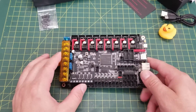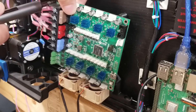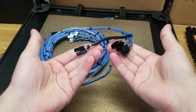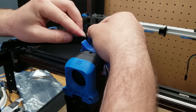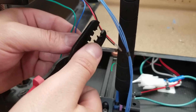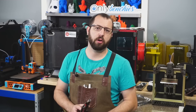Installation of this board was straightforward and simple — if you've ever installed an SKR-type board before, it's the same process, just a slightly bigger board. To make installation easier I used a pre-made wire loom from Linneo. These pre-made wire looms make wiring a Voron build much simpler — no estimating wire lengths or crimping terminals; it all comes pre-configured for the board and build size. I did add some Dupont connectors for my Hall effect endstops and had a bit of extra wire due to my oddball build size, but zip ties managed that easily.